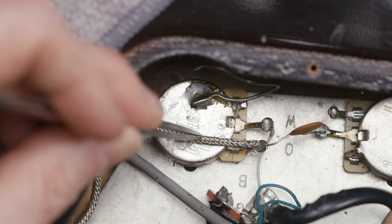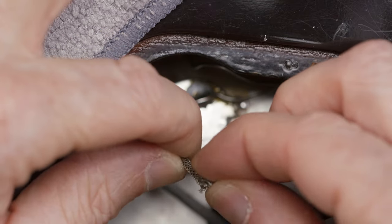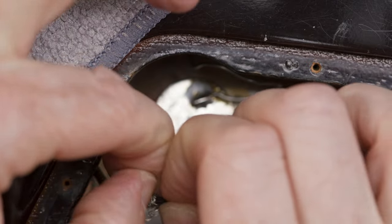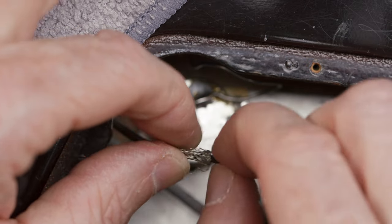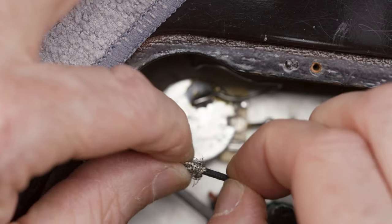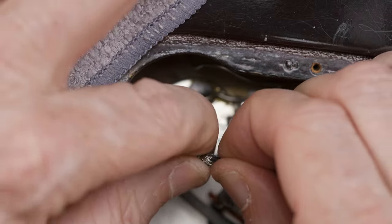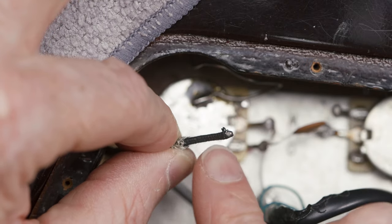This wire is going to look roughly like this, but we're going to peel it back. I'm just going to take this wire and peel it back a little bit so you can see I'm exposing this inner wire. We just want to make sure this part is not touching the hot lead, because it'll ground it out and you'll get intermittent sounds — it could even make your sound go away, which we don't want. It'll slide a little bit, and then I can twist this to make it stay in place.